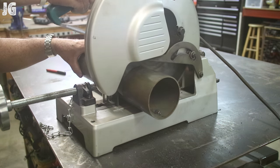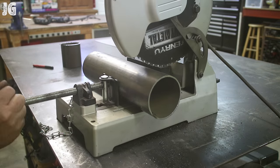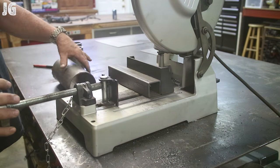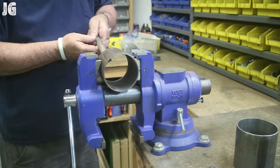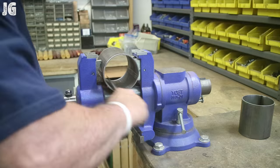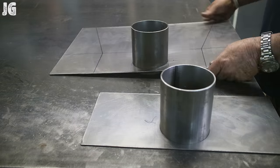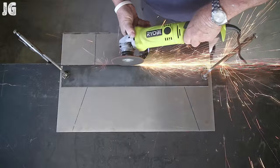I got a piece of four-inch pipe — this is an eighth-inch thick wall — and I just cut the two pieces I need out. Once I got those cut out, I took them over to the Yost vise, clamped them in, and deburred them. I love this vise — it's got so many features and options and works really well for round pipe. Once we got them all cleaned up, look at this nice fit — I was really impressed with the way that worked out. That's going to make for some good welding.